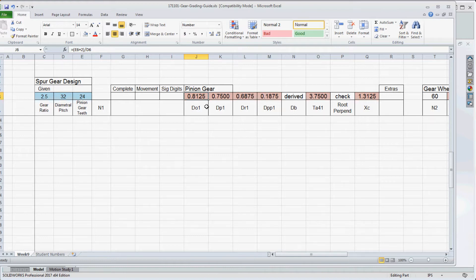We're looking for four significant digits in these values. We have a pitch point diameter of 0.1875. The base diameter is going to be derived through sketch geometry that we'll create. Then there's the quarter angular circular pitch — circular pitch is the span from where one tooth starts, through the gap, to where the next tooth begins. If you divide that in half you get a tooth; divide in half again and you get a quarter, which equals half a tooth. We'll put a line at that value and mirror one side of the tooth sketch to the other.